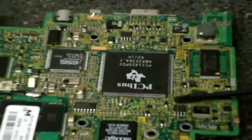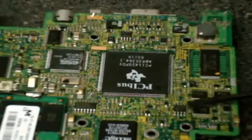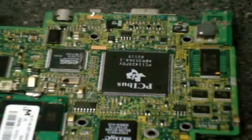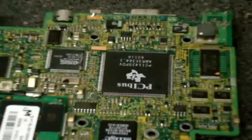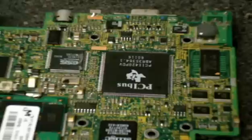On the opposite side, we count one, two, three. These two legs, while the system is powered up, we actually have to short out. You can use a paper clip, or you could solder a little wire on and just touch them together. We're going to just tap it a couple times like that while the system's trying to boot.